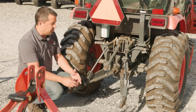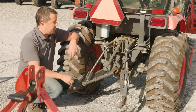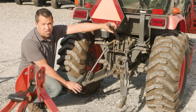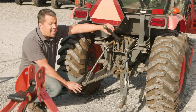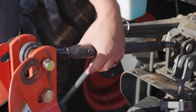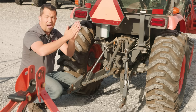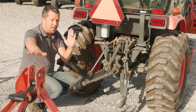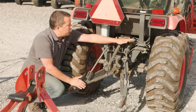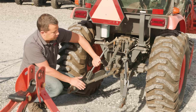We're going to start with some terminology because there's a lot of verbiage used when describing all of these pieces. Very simply, the top point of your three-point hitch is called your top link, and this can be turned in and out on basically every top link in order to adjust your implement — say if you have a rotary cutter it's going to bring the back of that implement up and down. Over here on the side these are called your rock shafts that lift from your tractor, and they're attached to two lift arms.